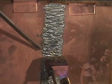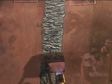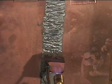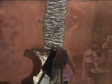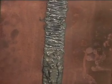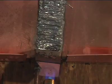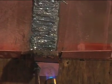Pivot the handle of the soldering copper and move back across the joint again, applying solder and flux as necessary. Continue to stitch down the joint. If you notice the joint coming apart, use a steel tool to keep the sheets together while removing the soldering copper and allowing the solder to solidify. Stitch all the way down to the bottom of the seam to the lowest point of the joint.